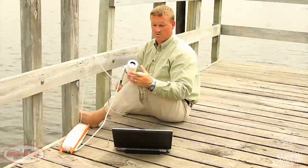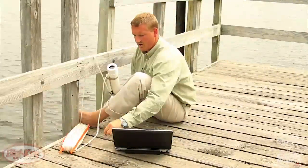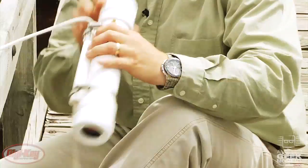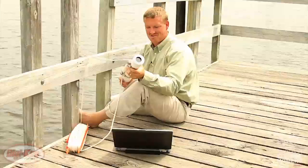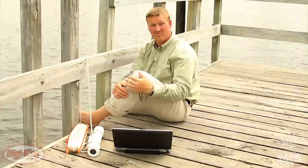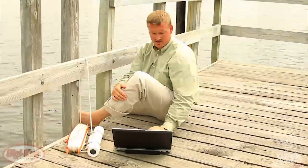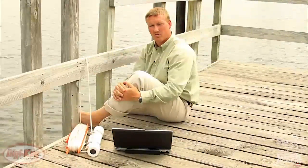To demonstrate this, we've got a GUI on the laptop. There's a reed switch inside that powers the unit up when a magnet is waved over it, giving us a blinking blue light to confirm it's powered. We're reading data via Bluetooth, so we'll stream some data as an example before switching to recording to EEPROM, since Bluetooth can't transmit through water.